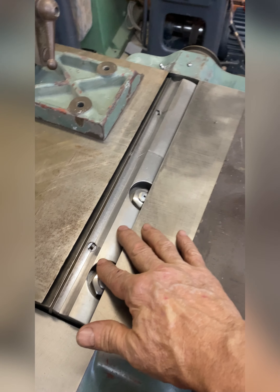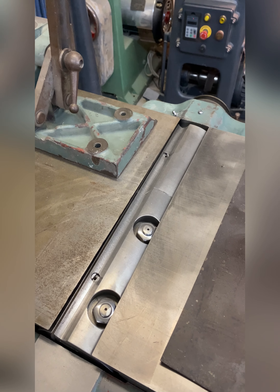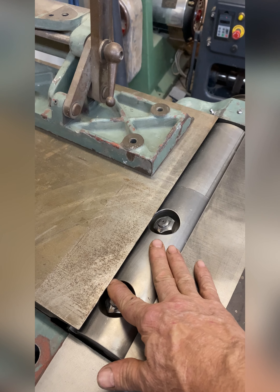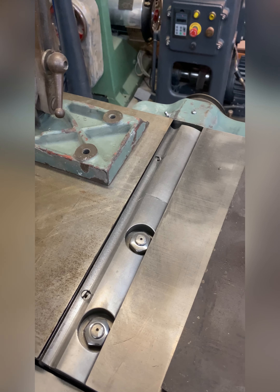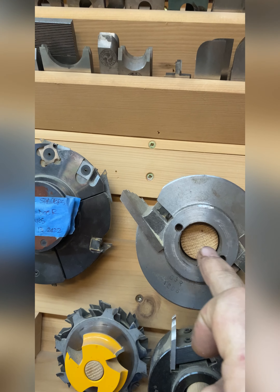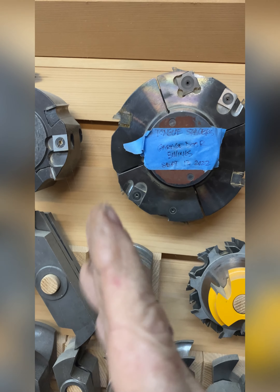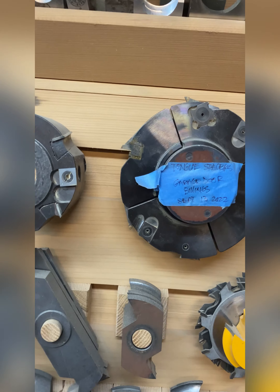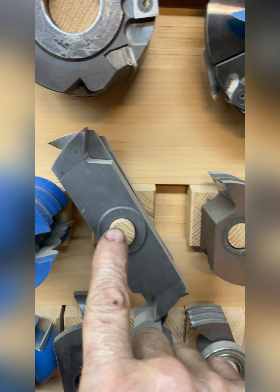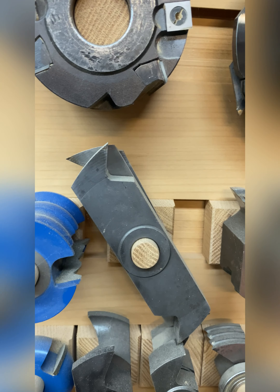This video is about molding knives that fit in a cutter block, and a question from Mr. Johnson about the rake angle of this cutter block. All kinds of cutter blocks have all kinds of different rake angles — that is the actual angle at which the cutter is attacking. In saw blades we would ask is that a negative or positive rake? Not all cutter blocks are the same; you can see this one is quite far back, and that angle right there is the rake angle.